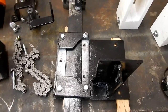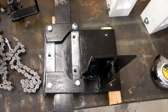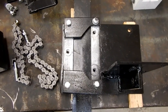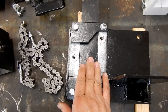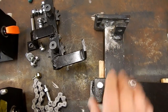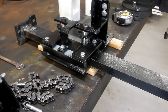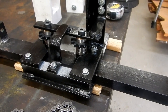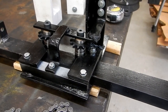This is what I call the front plate. It is a piece of quarter inch plate, 7 and a quarter inches high by 9 and a half inches wide. That right there would be your winch plate — this will mount your winch on. You've got 1 inch by 1 inch bar on either side of your log dog, and the 3/8 plate on top of the log dog. These stops right here are where the chain is going to bolt to. There's a top bracket that goes across the two shoulder bolts to give them some support since there will be stress on them going up and down along that log dog.